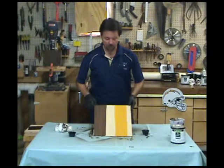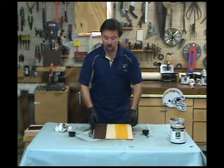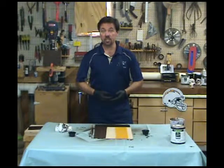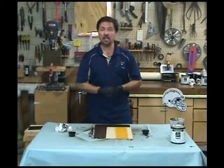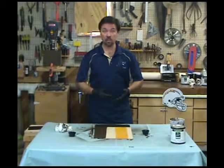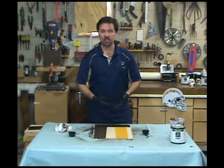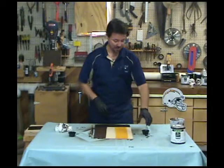I've let these dry up fairly well here. One other thing I might add about toners: when they're used properly and sprayed on, they'll actually almost work like a wood conditioner in that they'll control the depth of the stain to a slight bit. So some of the blotching that could occur on certain species — if you use a toner first, it won't happen as prevalently. Still not as good as a conditioner, but it definitely makes a big difference.